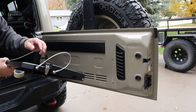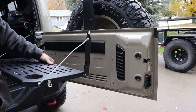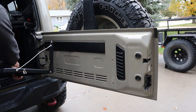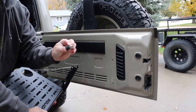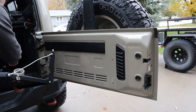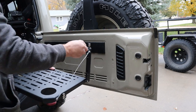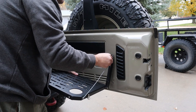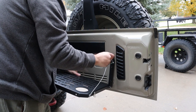Right here is where it went sideways. This is where I found out none of the holes lined up at all. So I had to actually adjust the huck rivets, re-drill and adjust the holes on the table, and realign everything. This took several hours of just playing with it and trying to get it as right as I possibly could.